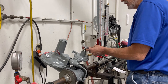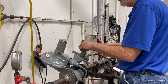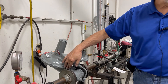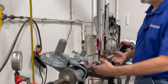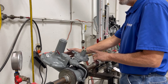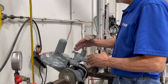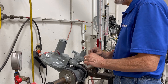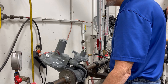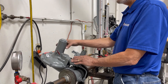RPCs are regulators that are slow to react. Once they are set they are consistent in regulating pressure downstream, but on initial start up they are slow. This is because there is a throat block in the main part of our regulator — there is a hole in that throat block so that it regulates very slowly, which makes it consistent. On your initial start up, make sure that you are opening your upstream valve very slowly so that your pressure can be regulated easily and the regulator has time to react.